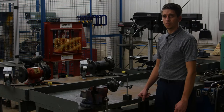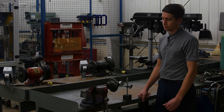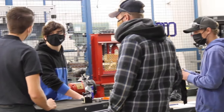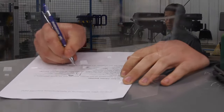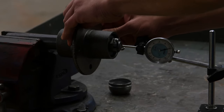Our Commercial Vehicle and Equipment Level 1 apprenticeship program is broken down into seven courses. One of those courses is brakes and wheel ends. For one of the labs in brakes and wheel ends, students have to disassemble the hub assembly, check for wear or damaged components, and talk about the actual issues that could arise from an improper setup. When we're talking wheel end assemblies, we need to have one to five thousandths of an inch end play. Students disassemble them, inspect, reassemble, and then confirm their measurements with a dial indicator. As part of our trade practices course they learned how to use dial indicators, so they set them up and confirm that they have the proper end play of that wheel assembly.